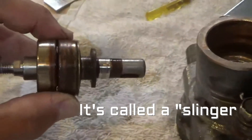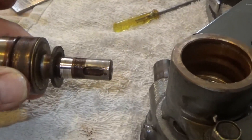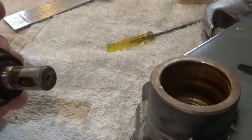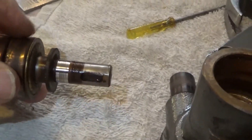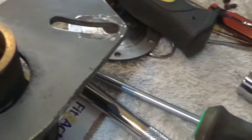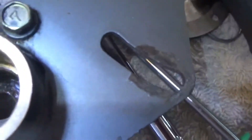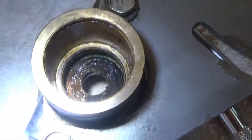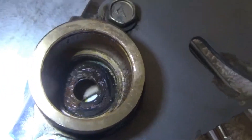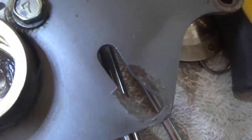These are the bearings. This is the impeller end — there's the keyway — and there's a little rubber-like spacer right here. The whole thing looks kind of gunky, and these bearings don't look that great, but they seem to be working okay. Let me get a flashlight in here — and here's the problem, or the cause of the problem. That seal looks pretty bad. It's distorted, it's all gunky. What a mess — it has sections that are broken off.